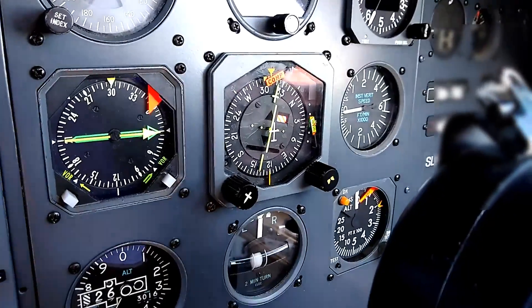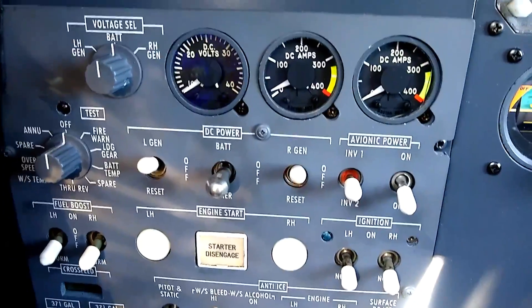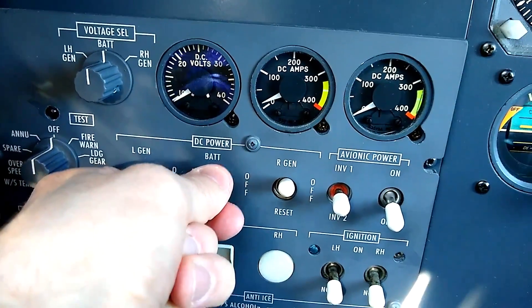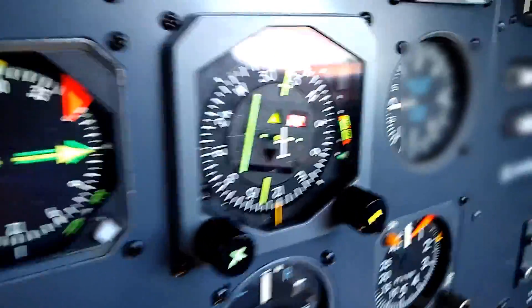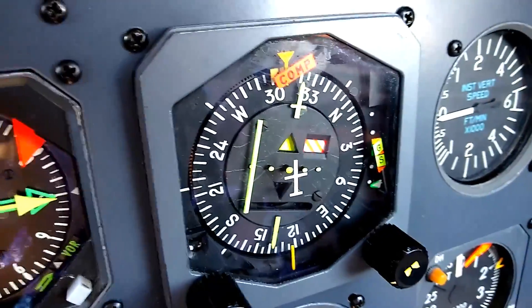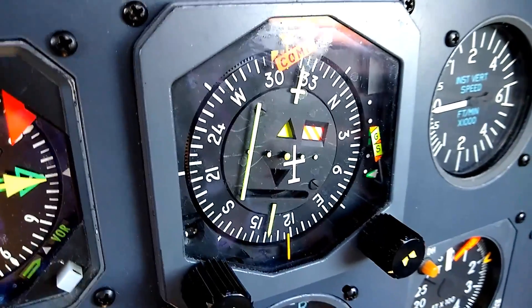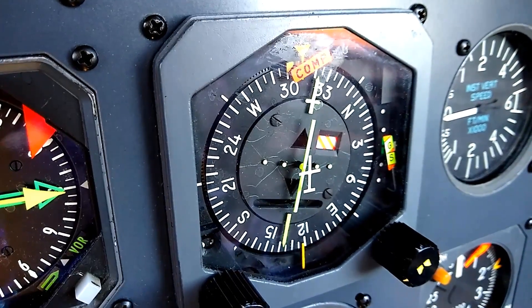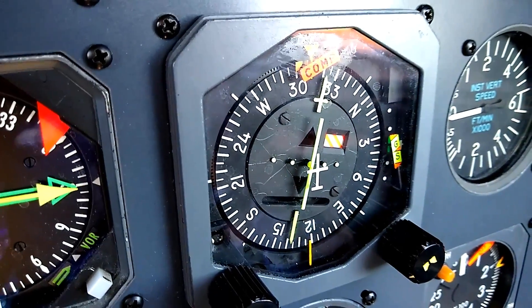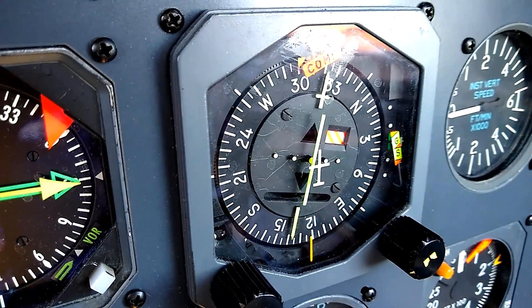There's not a lot of items on the E-mer bus. To check it, we'll check each piece of equipment. We'll start by turning the E-mer bus on and notice that the voltmeter comes alive, indicating our battery voltage. We're also going to look right away at the co-pilot HSI. As we watch it, it's going to spin up — it'll take a few seconds, maybe even a minute or two. We'll get the compass flag to pull, indicating the gyro is spun up. We'll also see the CDI needle move, as it runs through a few checks on the Garmin GPS system.